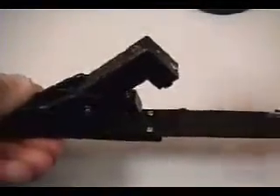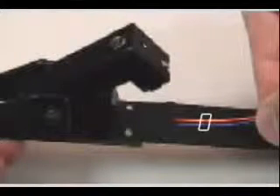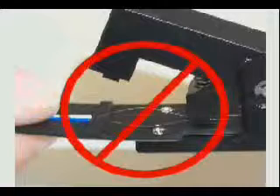Now with the fibers in one hand and the cleaver in the other, press the handle to open the fiber clamp. Using the slotted guide, slide the fibers onto the fiber clamp until both buffers touch the stop, and take notice of the visual mark alignment. This should be their final position when fully inserted into the connector. If both fibers were measured and stripped accurately, the marks will be exactly adjacent to each other. Release the clamp onto the bare fibers and gently press down the cleaver arm until it just touches the fibers and guide. Do not use excessive pressure, which may result in a poor cleave. Both fibers must be flat against the fiber guide and as straight and parallel as possible for a proper cleave angle.